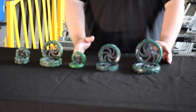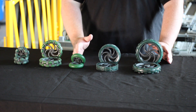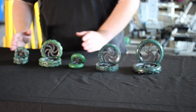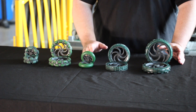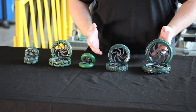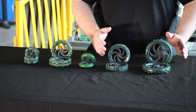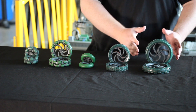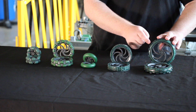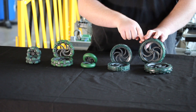We have our higher traction wheels and our omni wheels. Higher traction wheels are great whenever you don't need to be moving from side to side. The downside is that it's harder for your robot to turn and it likely has more friction turning, as opposed to omni wheels which have little to no side-to-side friction. When looking at the higher traction wheels, consider: are you trying to get over certain obstacles? Does a smaller wheel benefit you versus a larger wheel? Most of the time, using a larger wheel will get you across the field faster. The motor spinning inside always moves at the same speed, but the further out you are, the more distance you cover in the same rotation.